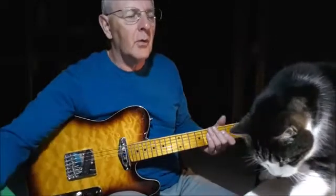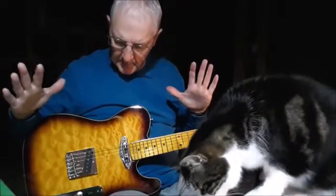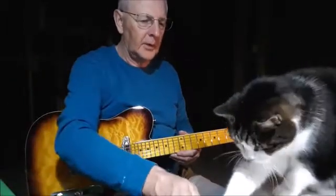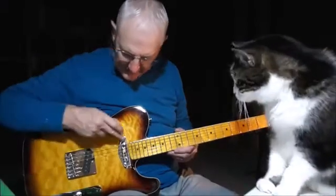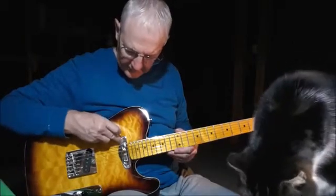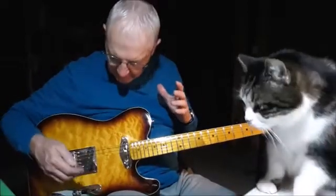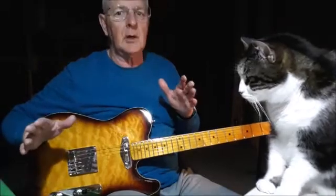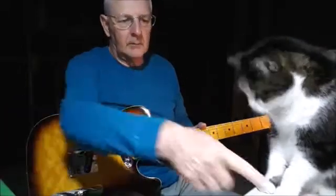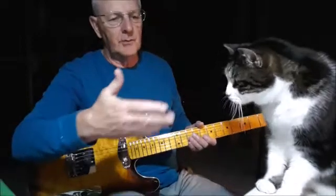So I just wanted to go over what was happening: now I'm not touching anything. The buzz is like 4 times less than it was before. And when I touch the neck pickup now, boom, just what I wanted, complete indifference to me touching it anywhere. If I touch the bridge plate, it still quiets down the tiny little bit of buzz, and I think it's because the pickups are probably slightly microphonic. And when I get close to the computer, which is right in front of me, it picks up a shh noise from the radio waves coming off of the computer.